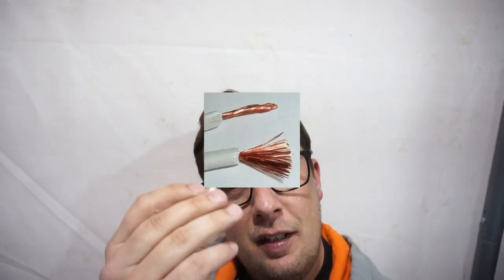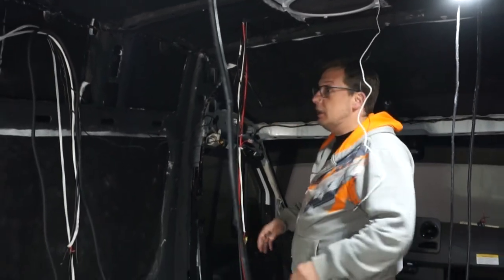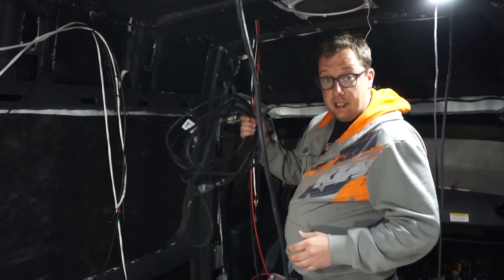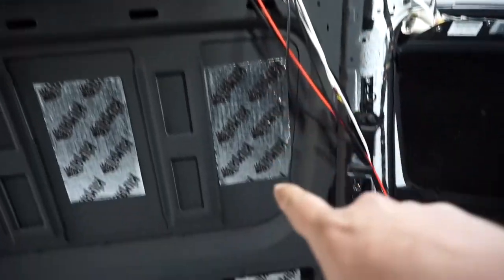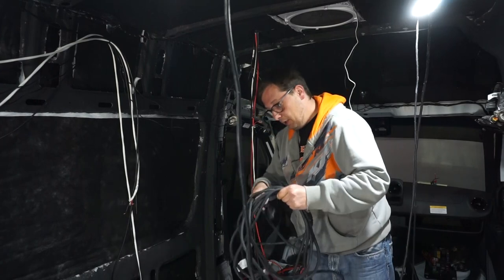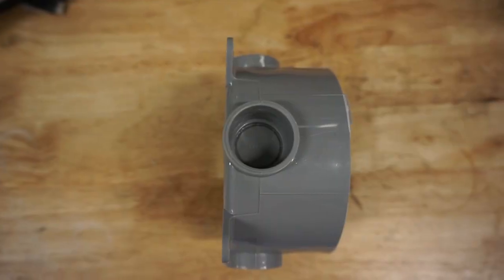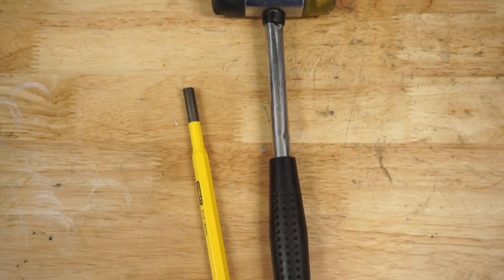Look at the disaster of wires we have in this place! From here we can start laying our 120-volt wire. Our inverter is going to be right in this area where we said our power unit was going to be. The male end of our wire just hangs down, then we follow it up and across where all our other wires were going, and straight down to where our junction box is going to be — the same ones I showed last week that we had to prep before putting the insulation on.